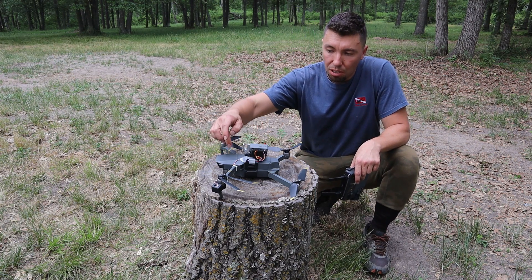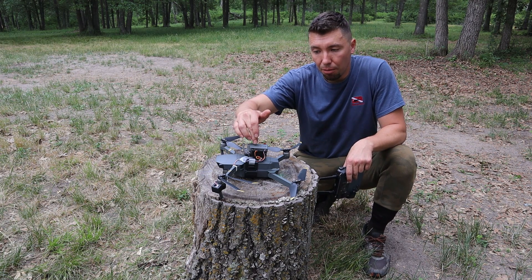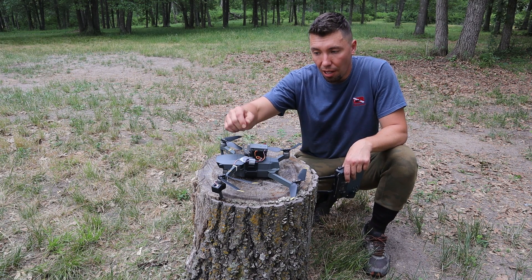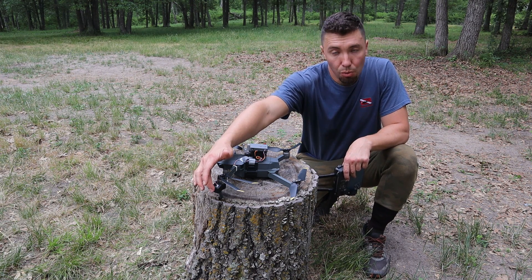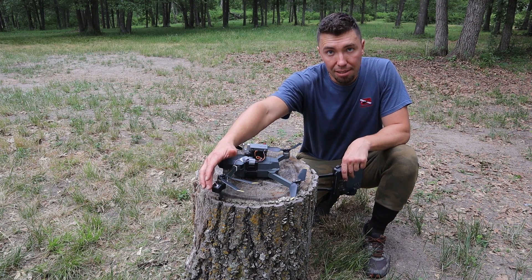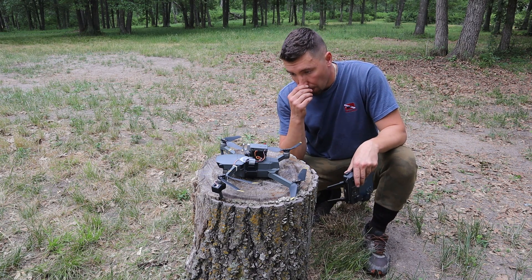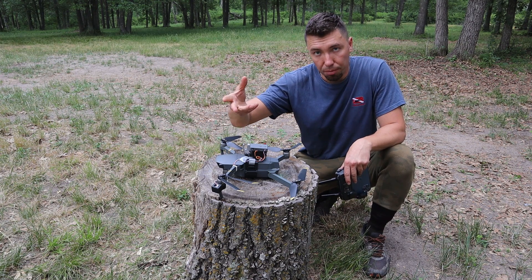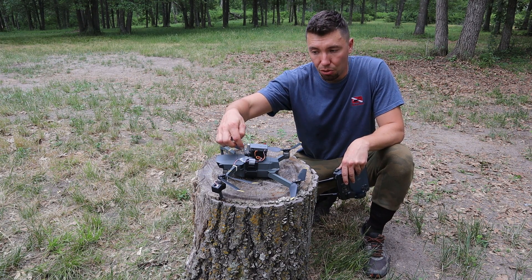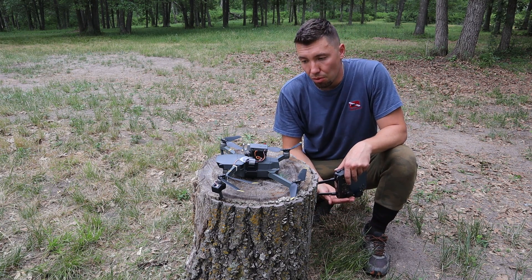For this I will be using a DJI Mavic Pro, and I purchased a special adapter that mounts on top of the drone. It has a little servo motor which is controlled by a photo sensor that goes right over one of the LED lights on the drone. Whenever you take a photograph or record a video it flashes, and whenever it flashes the photo sensor releases the motor, which drops the weight I will be stringing across the trees.